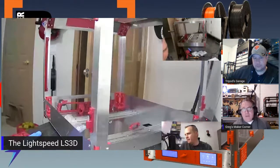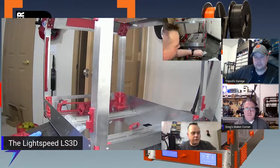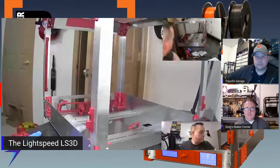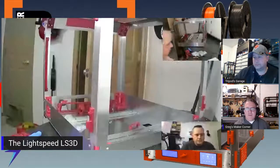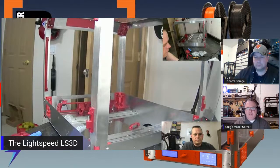But now, do you know if this one has a BOFA filter option? Okay, that's cool. Actually, let me take that back. Greg, you know better than I do what BOFA means, but it does have a HEPA filter, if that's what you mean. If I remember right, BOFAs are like $1,000 VOC filters that are separate, and you can connect a hose to them. But if this one's got a HEPA filter in it and it's all enclosed, then you're probably not going to get rid of your VOCs, your volatile organic compounds, as much.